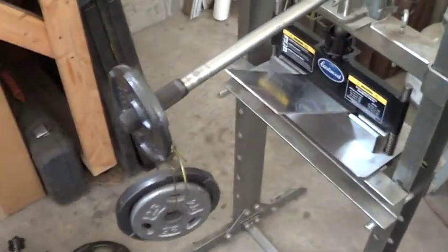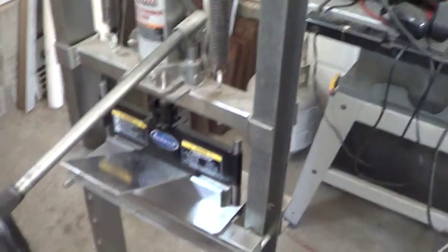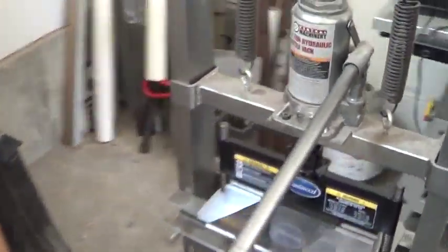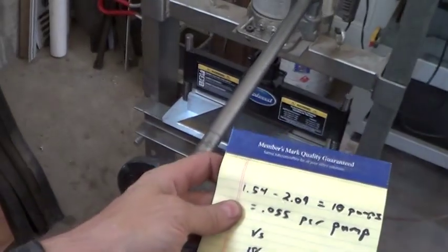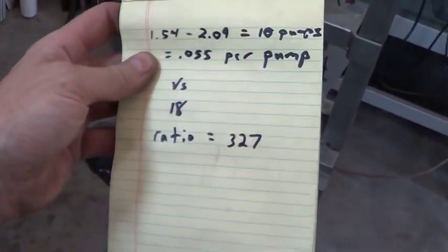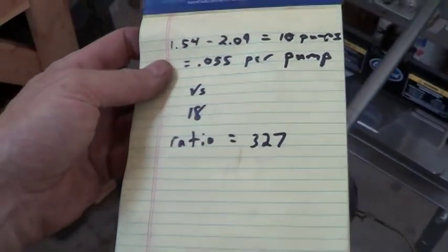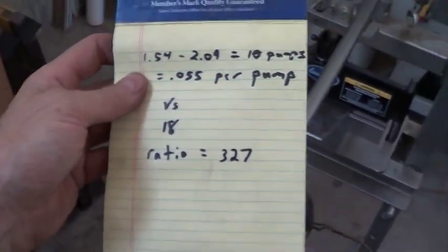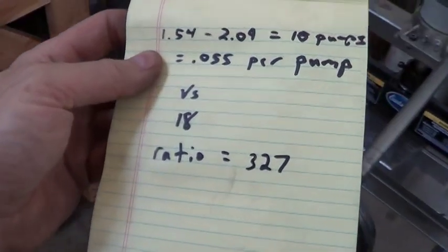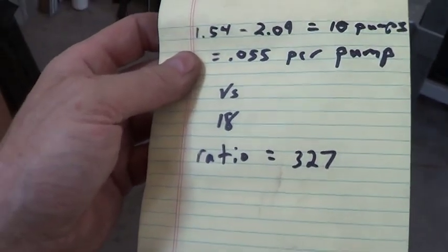We're going to call that 10 pounds on a six-inch piece of aluminum, and we multiply that by approximately 300, so the downward pressure in rough numbers is 3,000 pounds on that piece of aluminum. That turns into about 6,000 pounds per foot, which is 3 tons per foot. If I have a 20-foot long section, that turns into 60 tons. So we need 60 tons to make this happen.